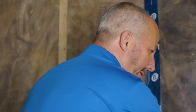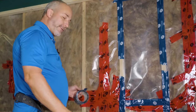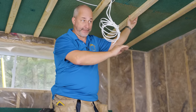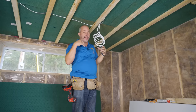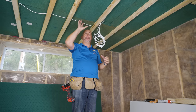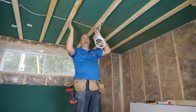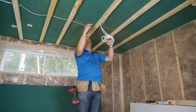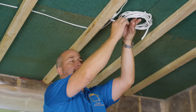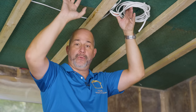For the record, when you're opening up a wall, if you cut in the middle of the joist, you have something behind it to put pressure on for a good seal. Now when it comes to lighting in a theater room, you've really got two options. Wall lights — like sconces — are common in theaters because you can have a box, putty pad it, and it's a pretty decent seal. In a ceiling, if you want pot lights, there are two ways: create a five-sided box your pot light can be cut into out of the green board, or install all your green board tight and then run another layer of strapping with a two-by-three for wiring. You drill your hole, wire your device box, slide it to the side, install your pot light, and you're not breaking through your sound barrier.